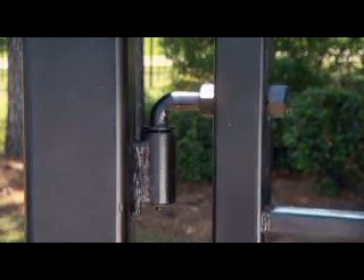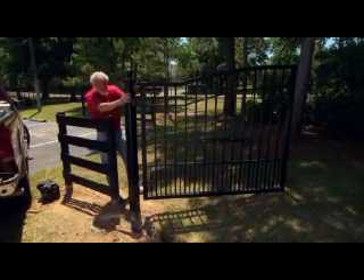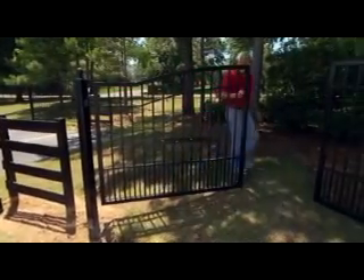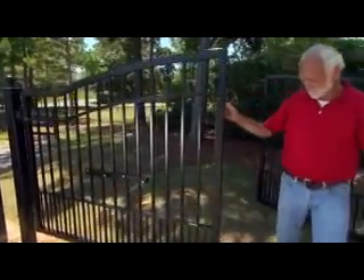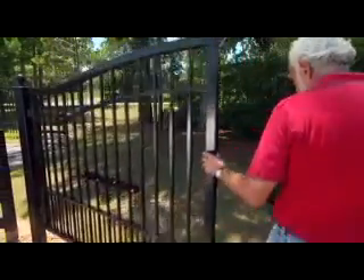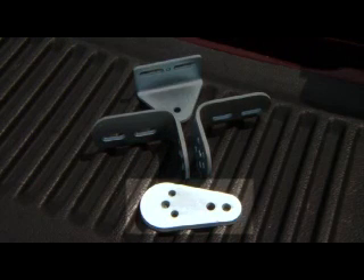Never use wheels on your gates. Your gate leaves should be installed on fence posts that are firmly secured in the ground. We recommend positioning the opener arms near mid-height of your gates. It may be necessary to add horizontal or vertical cross-members to provide stable areas where the gate brackets can be mounted. On round posts of 6 inches or larger, the post-pivot bracket may not be necessary, allowing for the post brackets to be mounted by themselves. In this demonstration, we will be using the post-pivot bracket.